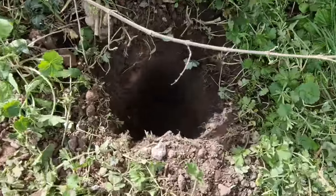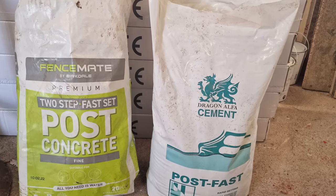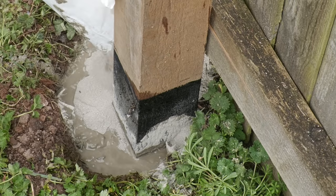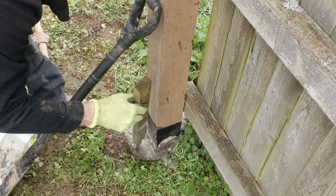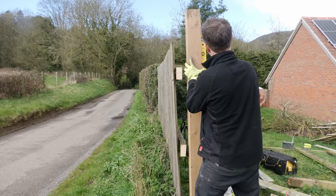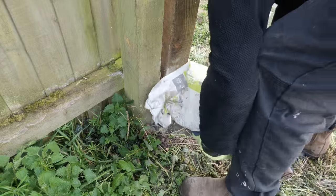By about two o'clock I had two holes ready for the posts, each about 450mm deep. Setting each post in concrete is blindingly simple and very satisfying. I use fast-setting mix as I don't want to wait overnight for the post to set solid. I simply lean a spade up against the post to get it roughly in the right position, pour water a third of the depth of the hole, and then fill with the cement mix until above the surface of the water. I think it's better to get a stick and drive it right down to the base of the hole, as you'll find there are lots of pockets of unmixed cement. With this done you've got about five minutes to adjust the post position to get the spirit level perfect — and you don't need any supports because by this point the post is already pretty firm.